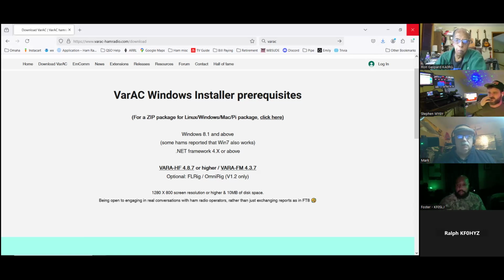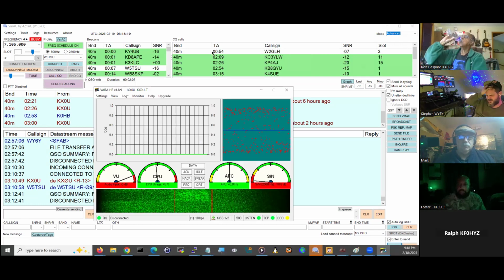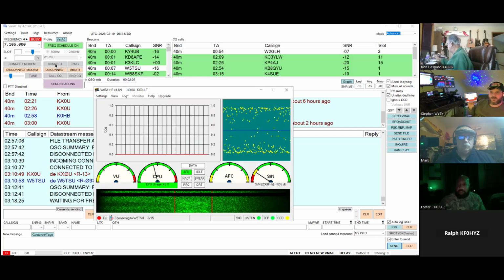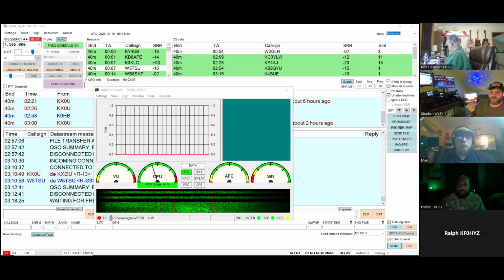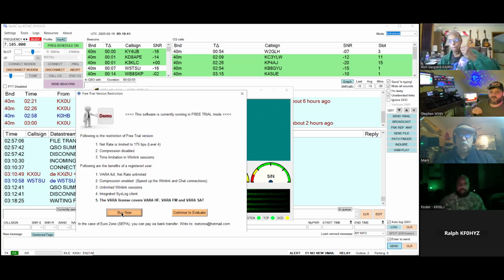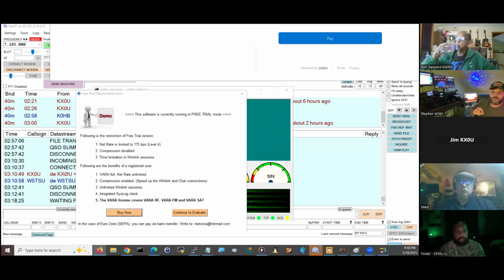Yeah, so the way it works is the man who developed the actual VARA modem is a Spanish ham operator, and his call sign I can't remember off the top of my head. I did a video about this recently, but he will let you use the modem free of charge, throttled. So no matter if you're using it on 500 hertz, 2300 hertz, or even up to 2700 hertz now, it will be throttled. Now, if you do pay for the modem, the $65, you can use it pedal to the metal, full force, and it is noticeably faster. And you'll notice it more if you are doing file transfers or you're doing WinLink.